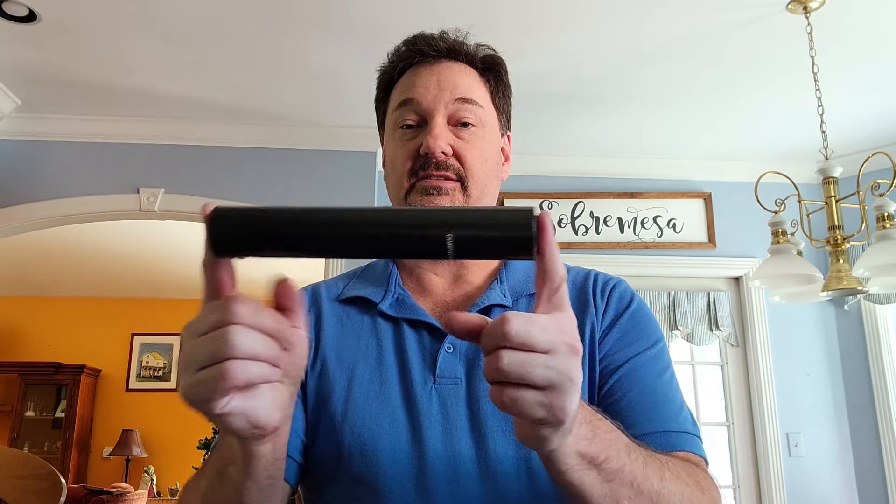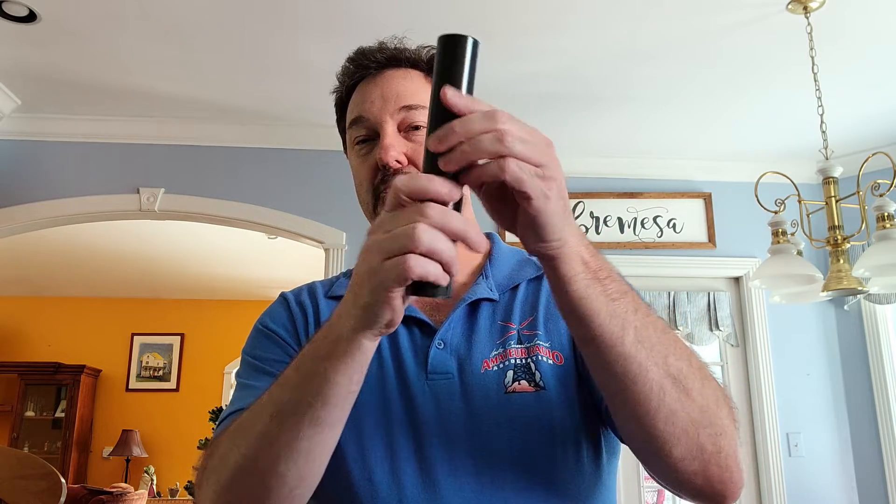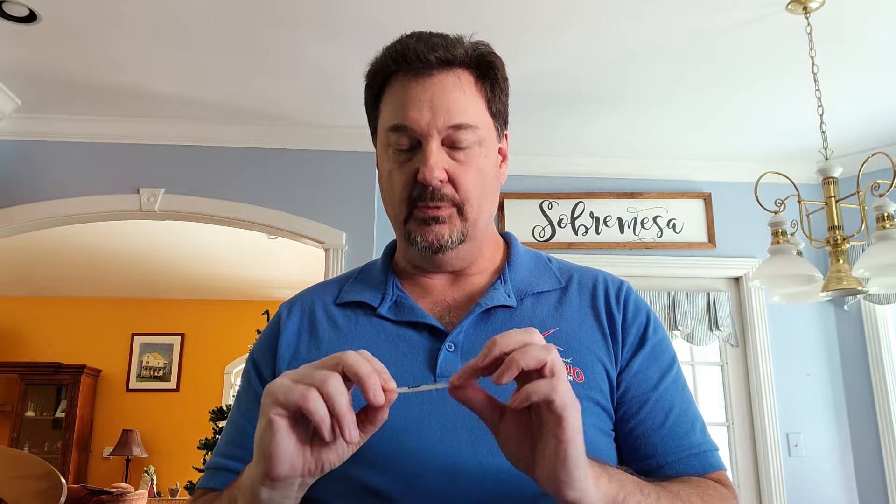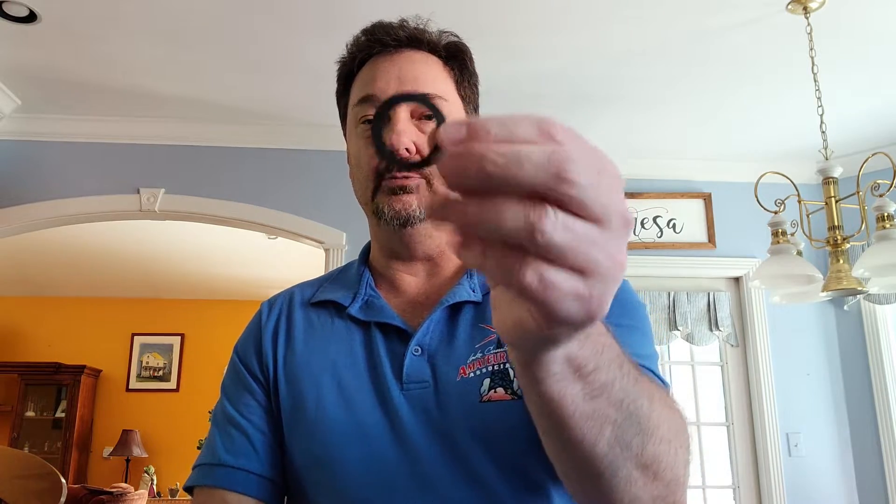First thing, of course, is the compact antenna. It's a little bit longer than the 7½ by an inch and a half, and again it has that NMO connection. We'll just screw that onto the magnetic base. Dr. Jack was nice enough to send us a base that he recommends. I got lucky ordering the cheapest one I could find on Amazon, but the main thing is that it's pretty flat. I'll show you the one he sent from Laird Electronics — or rather Laird Connectivity. It looks to be about a 2½ to 3-inch magnetic base.